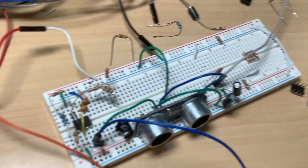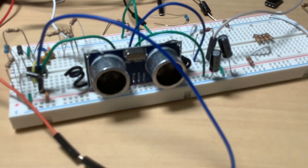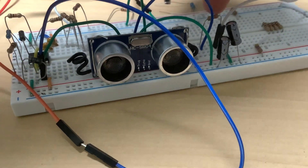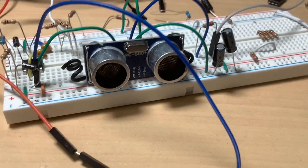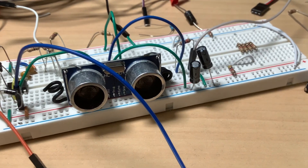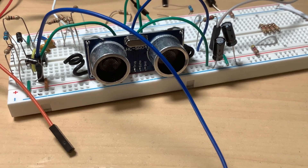To see what's going on, this circuit consists of several components. Basically you have your 555 timer right here, which is generating a pulse that goes to the trigger of the ultrasonic sensor. The sensor has a trigger and an echo — the echo goes to these capacitors, and this capacitor and resistor form an RC integrator circuit. The trigger sends a pulse out, the echo detects a pulse back in, and the length of that pulse correlates with the distance.